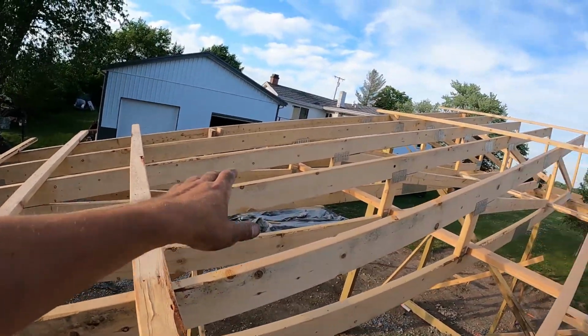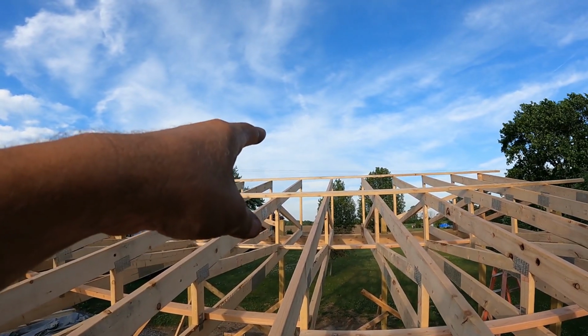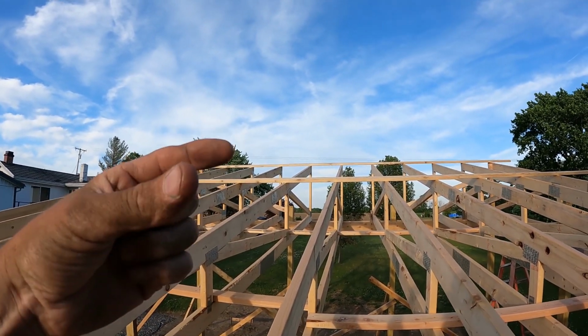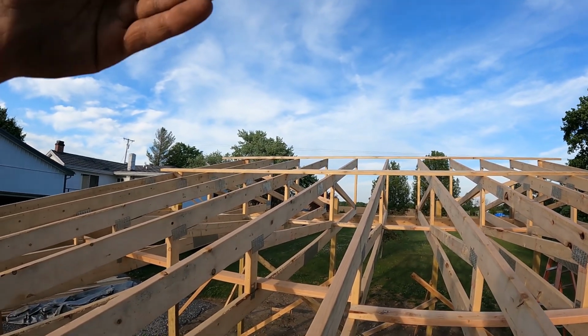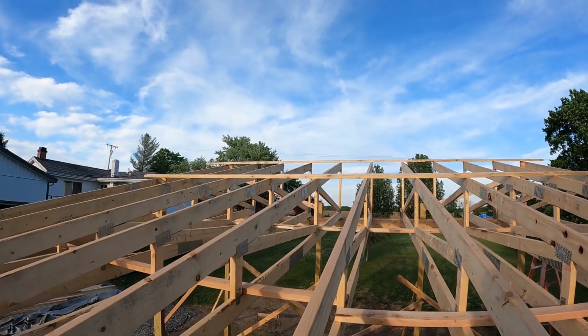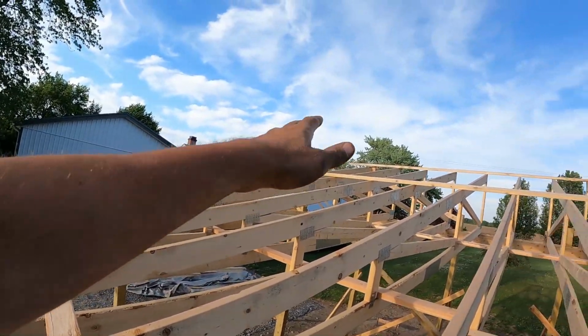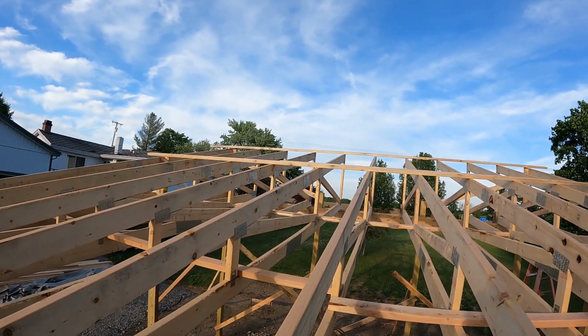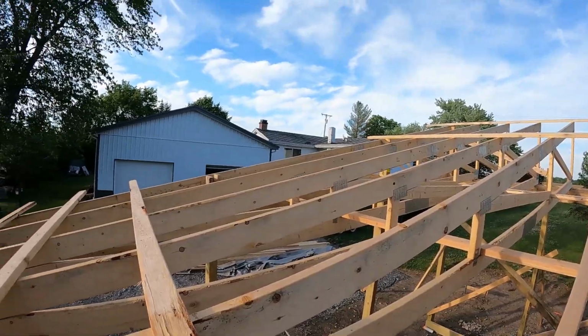When I'm working my way up with the purlins, I'm just going to keep going all the way up to the top. And then I got a 2x6 up top there, an inch and a half proud, I think I told you, sticking out past the side. And that'll allow the board and batten to come up to the bottom of it, and I can run my trim detail around. I'm just kind of working my purlins up, and it's slow going. Still windy, but it's a nice day.